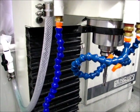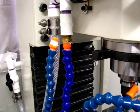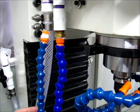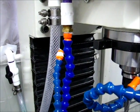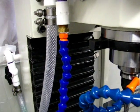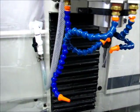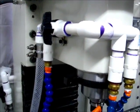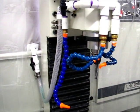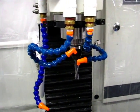The size difference between the two is pretty substantial. The one I'm holding on the left is a quarter inch lock line size connection, and then this one I'm guessing is half inch, judging by the fitting size. I haven't actually seen a half inch on the market in person, so I don't know for certain — that's what I'm speculating. I'm going to run a flow test with the front two nozzles closed and see what the flow rate is through the larger half inch diameter nozzle, to see what sort of restriction the quarter inch lines provide.